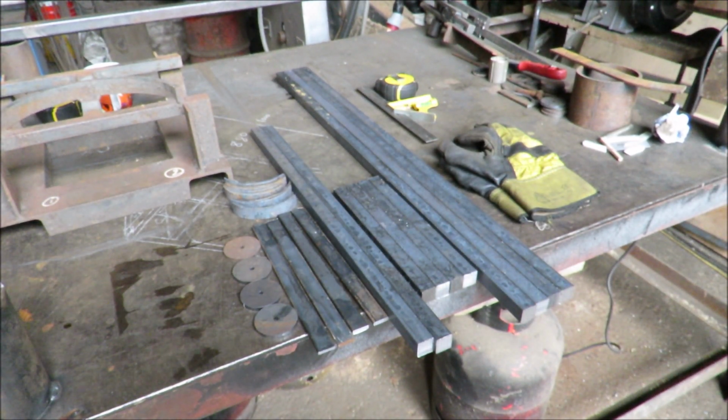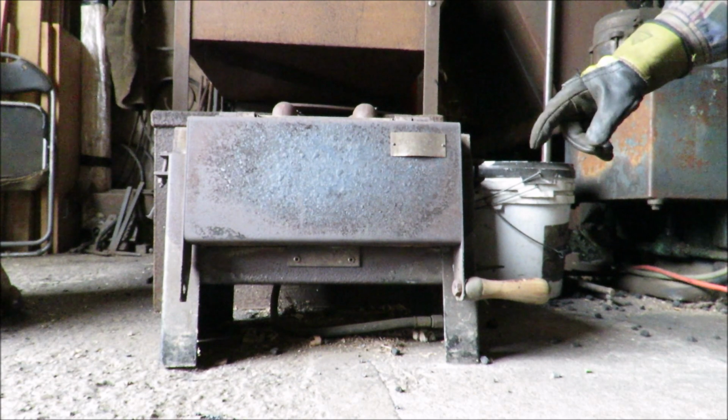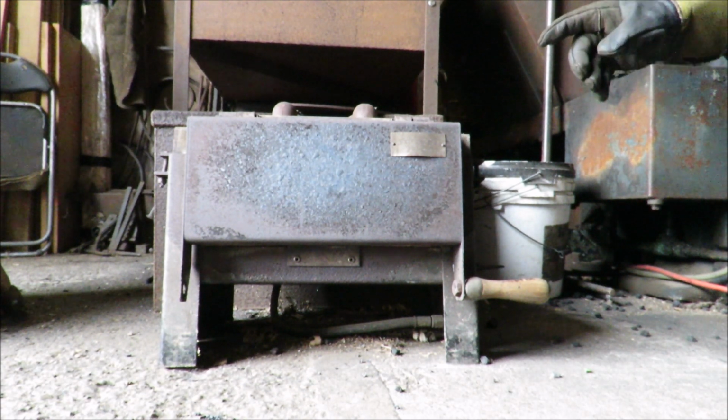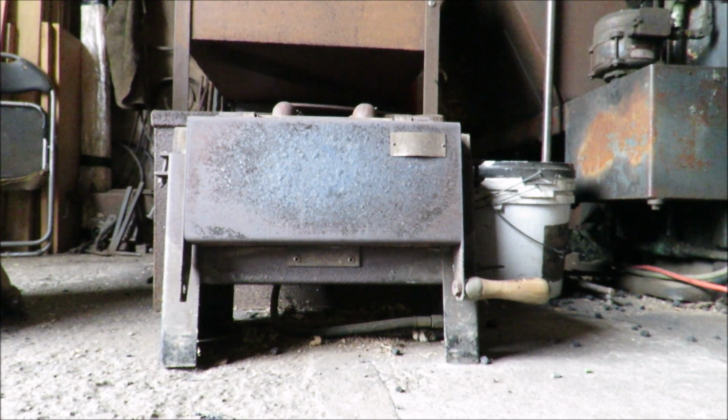So now we put this all together like a big Lego kit. Yeah, they just stick together, just like there's a bit of heat involved. I hope so. Yeah, that'll be a bit. So, what's this afterburner of a jet thing that we've got? I know you mentioned it in the last episode, I think. So the propane tank behind the coke forge is powering this gas forge. Now these are more common in the States actually, but I couldn't do without it. I mean, some blacksmiths get a bit sniffy about having a gas forge. They think they can do everything on their coke forge, but actually it's a wonderful tool.